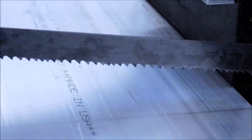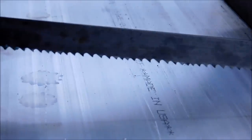This blade is ideal for cutting everything from 316 stainless to 6061 aluminum, and I leave it set at basically the same speed on the machine — I think it's 265 if I'm not mistaken. But don't quote me on that; if you really need to know, inquire offline and I'll look it up.